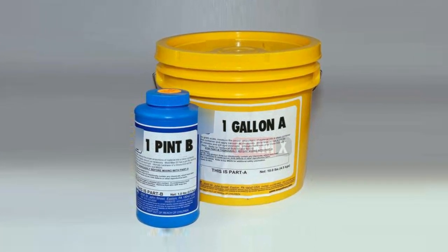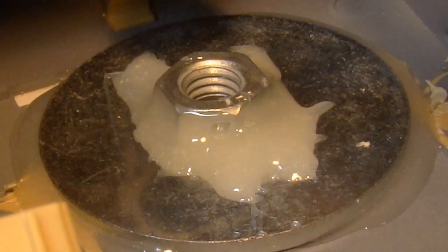Good quality epoxy is what's known as a 100% solid, meaning it doesn't require chemicals like styrene to keep it in liquid form. It's used in the same way as polyester when working with fiberglass products, and has a fantastic adhesive property if you have to bond 2 surfaces together. Epoxy resin will never turn into a solid unless parts A and B are mixed together, and the fact that it doesn't require any chemicals like styrene means it doesn't put off any strong or toxic odors as it cures.